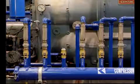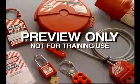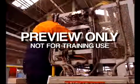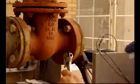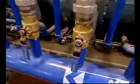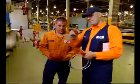Lockout procedures frequently address a number of different energy sources and often combine a number of different methods for isolating or blocking these hazards. Apart from the obvious use of locks and tags, activities can range from the actual removal of parts of the equipment, including linkages, push rods, belts, and flywheels, to the use of items such as chains, wood and metal blocks, clamps, pins, hooks, and blank flanges for closing the ends of pipes. Many pieces of equipment also have their own built-in lockout devices. Clearly, lockouts can range from simple to complex, but all should be regarded as equally important.